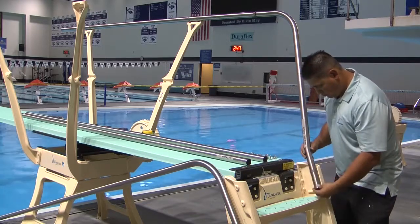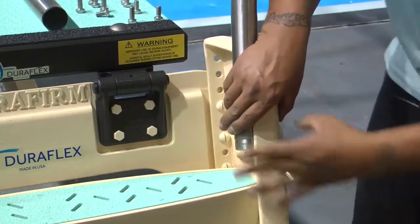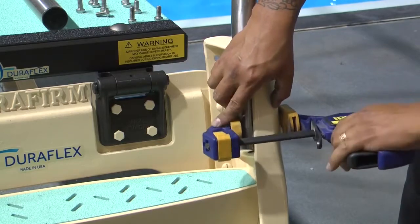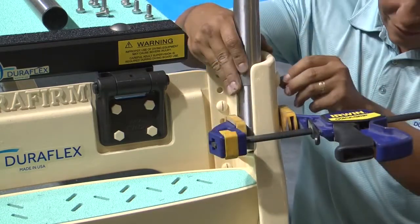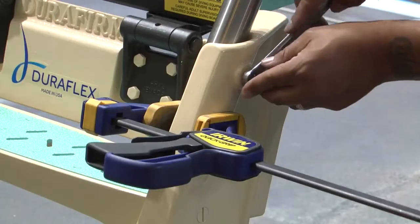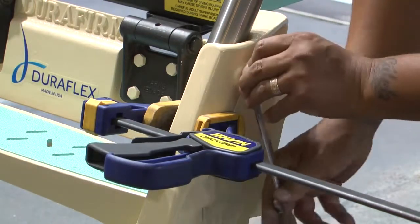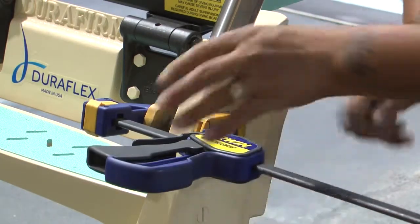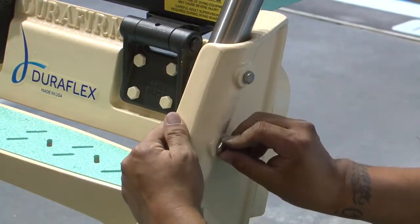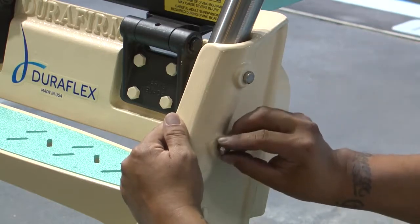It may be helpful to loosen the other rail clamps to allow the rail end to fully seat into the socket. Use a one-handed bar clamp to pull the handrail end as far as possible into the socket. Insert the shortest bolts that will engage the threads and tighten them. The bolts used up to this point tighten the clamp around the rail and will most likely be too long and will bottom out. Once seated, these bolts should be removed one at a time and replaced with the shortest bolts possible. Use this procedure for all rail clamp bolts.